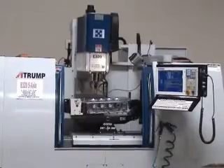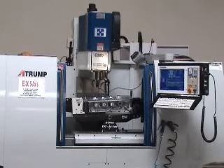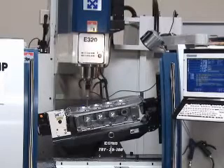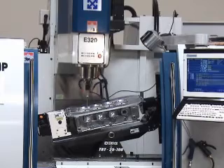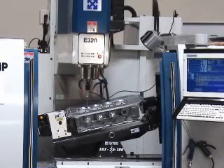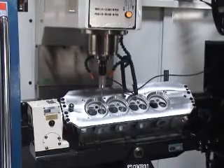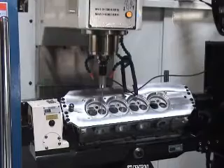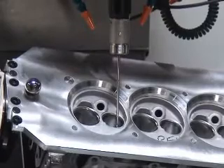On this head, one intake, exhaust, and combustion chamber were ported to the desired shape, then digitized to create a CNC toolpath. Digitizing is done by the Centroid DP4 touch probe, reading the surface of the hand-ported combustion chamber and ports. By using revolutionary 5-axis digitizing, we are able to drastically reduce the digitizing time required, as well as getting a better surface to use in Mastercam CAD-CAM software.